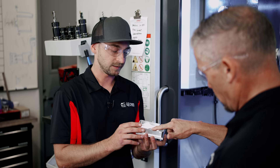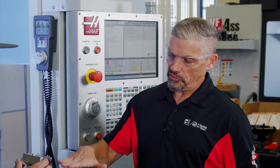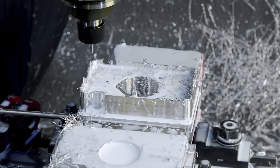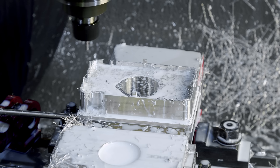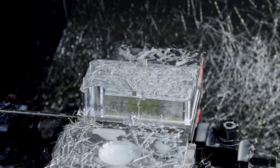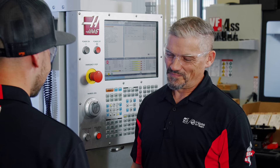So you're basically finishing right at this deck here. That's the name of the game with thin-walled parts — take small step-downs, always try to cut where you have rigidity. I'm doing three step-downs, each about three-eighths of an inch, varying from a quarter to a half inch. The next step I rough out the layer right below these slots to have enough room to come in with a small tool and finish the slots. This is still almost a solid chunk of aluminum at that point, so there's no deflection and no chatter. As soon as we start actually pocketing, the first thing I did was poke a gigantic hole in the middle of the part — this allows for high material removal rate, and it lets all the coolant and chips drain out so we're not cutting in a swimming pool full of swarf.